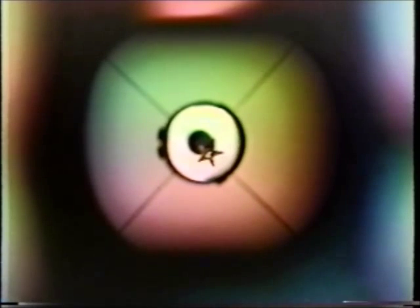We're going to be adjusting on the mirror cell that has the springs and the screws. It's really quite easy to adjust this kind of mirror cell. If that axis doesn't work, just change axes. Bring it over till we're close, then switch to another axis. The advantage of having the star is that the little points extend out beyond the circle. If you used a round dot on the primary mirror, it's very difficult to truly center it up. That's all there is to adjusting the primary mirror.